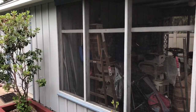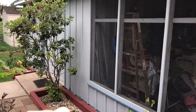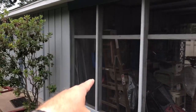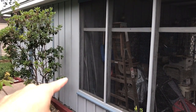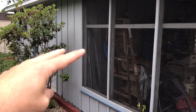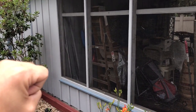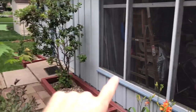And the piece that I probably did not mention is, hey, these boards are coming off, where do we put them? Well, we're not just throwing away the spline. We have to take that board off. That board right there is going to be 80 inches long, and that one is going to be 86 inches long, because when they build these things, they're never squared. They're cutting them as they build them. So I have to take these two pieces off and lay them in the grass so that when we put them back up, those two exact pieces are coming back up here. So there's extra non-value-added time for me to take these boards and lay them down so that we can put them back up, right?